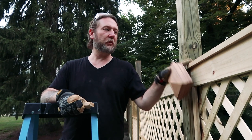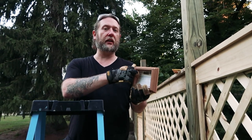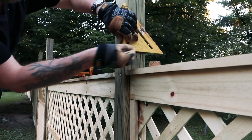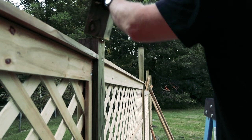We finished up our fence panels and put a nice cap on top, and now we want to put a cap on top of our fence posts too. We're going to have to cut these off, but we have to account for the little lip inside. So we made a quick little jig — that way we don't have to carry around a measuring tape for every post. Put the jig up, make a mark, and go from post to post cutting them off with a sawzall.